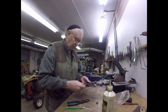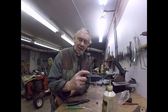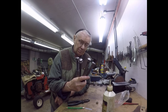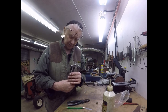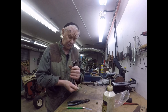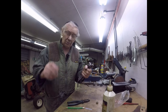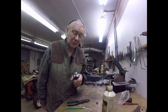And there we go, folks. Drawbars in 3/8 Whitworth, half inch Whitworth, half inch UNC, and metric. That's 12 mil, isn't it? Yeah, metric 12 mil. So we've now got a full complement of drawbars for the vertical head, which I'm sure we will find that we buy something off eBay and it's got a different thread in it, but I can't think what it would be.